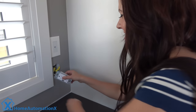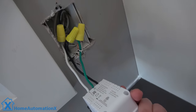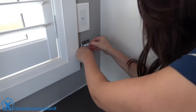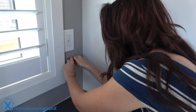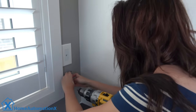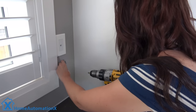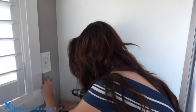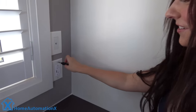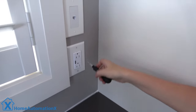As you can see, we have installed the outlet and matched the wires — the white is going to the white, the black is to the black, and the green is to the green. I'm just going to push it in here, tidy it up, put this in and grab my handy tool here. And voila, match it up. It would help if it wasn't in reverse — I never pushed it back. All right, we've got this covered. Just make sure that you lock it in and you are good to go, and do the same for the bottom.